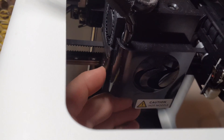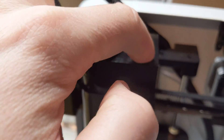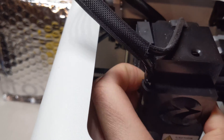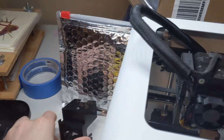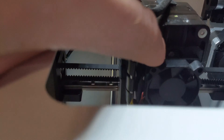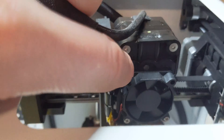I've loosened those two screws — one on each side — and this little plastic cover comes off. Make sure you don't have any filament in there, and this little cable comes out of its hole too. Once the cover is off, you can see the front of the device. Here's the cooling fan, and the piece we need to get to is right behind that little silver bolt, which I believe is the pin the extruder gear sits on.